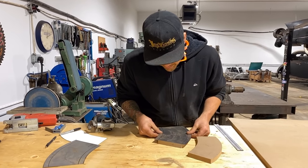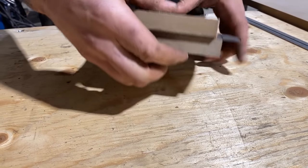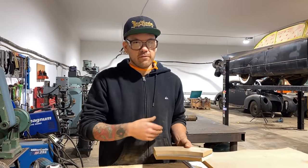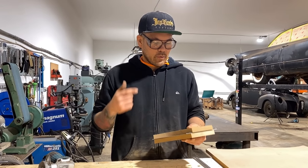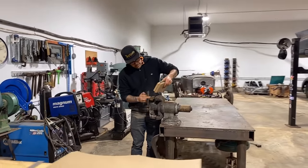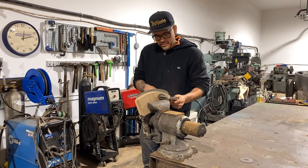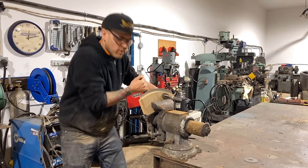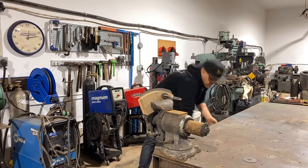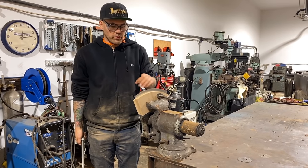We're ready to clamp this in our hammer form. Some guys would bolt or screw these together, but if you have enough clamps you don't need to. That way you don't have to fill the holes afterwards. For today's demonstration I'm going to use just clamps — as long as you've got some beefy clamps you'll be fine. I'll use the vise for some of it and run extra clamps to be sure. The last thing you want is any movement or slipping. Four small screws will also hold this together quite well.